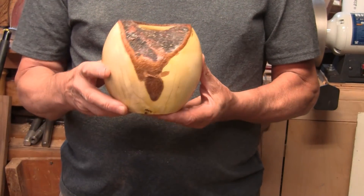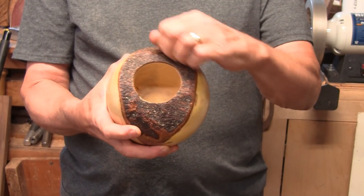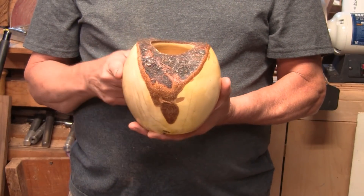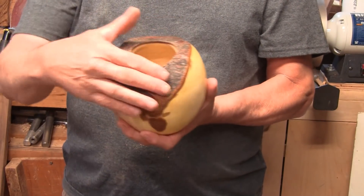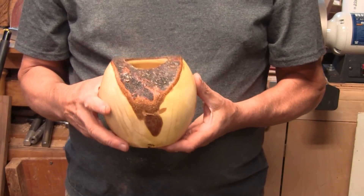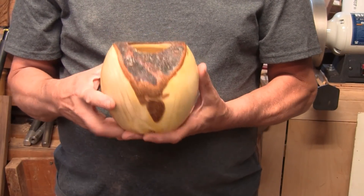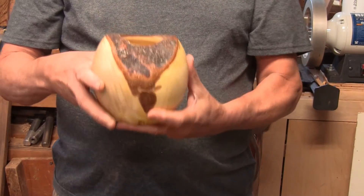Here's the little hackberry pot and I think it looks pretty good. My favorite part is this bark — it looks like rusted cast iron and it feels like it, it's just very dense. I really love the color underneath that bark when I turned and sanded through it — it's a very rich color. It's about 5 inches tall and 5 and a half inches in diameter at the widest, and the base is about 3 and a half inches. The walls are pretty close to a half inch everywhere except where the wood was missing, where it comes up to about an eighth of an inch. I used Zinsser Seal Coat and then Zinsser Shellac for the finish. I went over it with Scotch-Brite in both gray and white. I still had a couple of spots I couldn't get out, so I used the Axe polishing paste and 2,000 grit and went over the whole thing. It's about as smooth as you could ever get it.